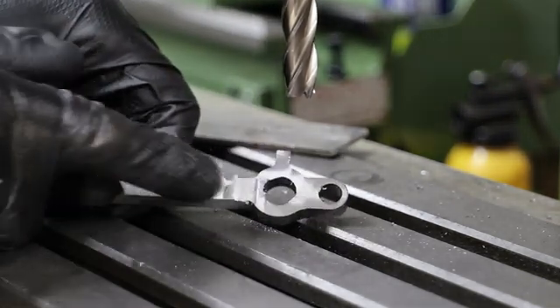Next I need to reduce the thickness of the section that fits in the knuckle joint at the rear of the rods. Don's design is quite simple, and I go with something slightly different — rather than just a straight cut across, I cut a radius, just because I think it looks a bit nicer. And finally I cut the recess for the cap on the leading crankpin. With these last three operations done, it's just a bit more time with some emery and some files to really tidy these up and make them look good.